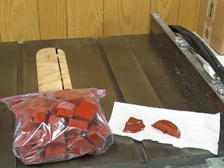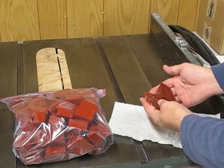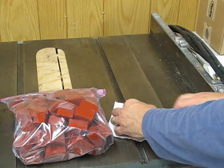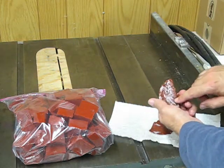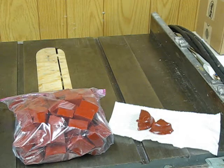It turns out that melting the old rollers was pretty much a total disaster. When I melted it, it basically turned to a lumpy glob rather than a nice smooth liquid. I tried heating it up to almost boiling point, I tried adding extra water, and the best I ended up with was sort of a lumpy soup once I added quite a bit of water. I strained the hot composition in a sieve, let the liquid harden in a cup, and after hardening it has been drying ever since and slowly shrinking. Unfortunately, in the meantime it's got these little moldy bits on it — little black spots — so this stuff has too much water in it and it's going moldy, so I can't really use it.